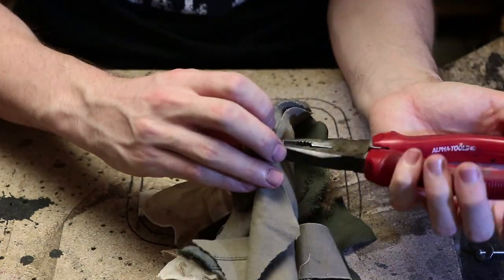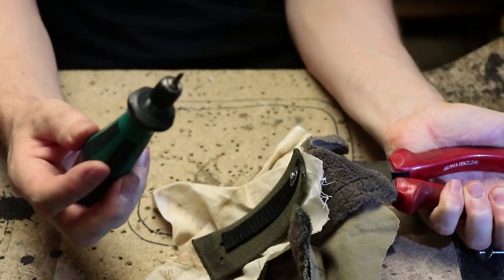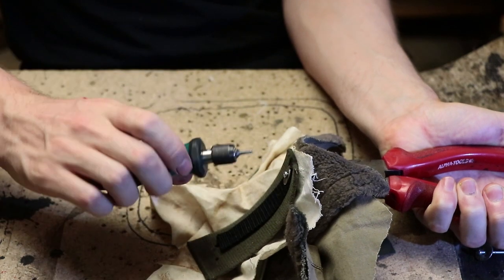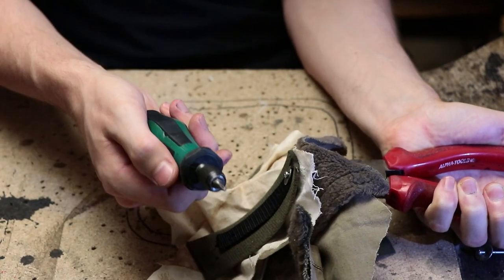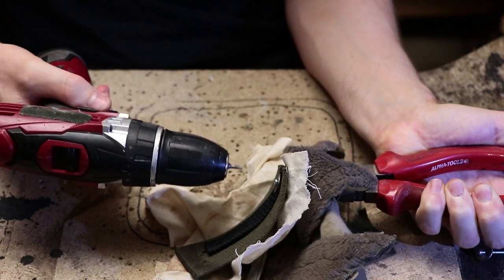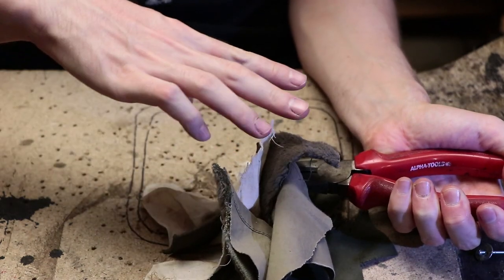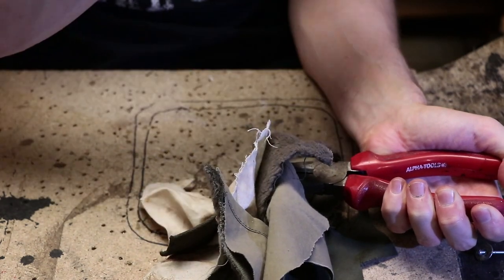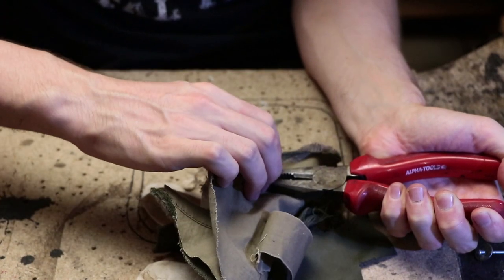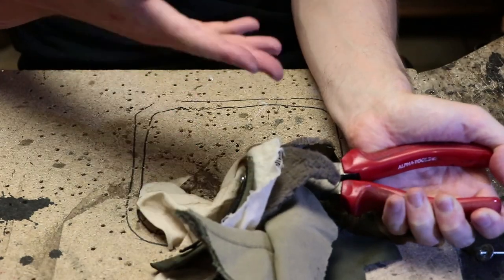When I'm done with that, I'll grab this nut on this side with my pliers and hold really tight, not letting it go. If I want the ultimate feeling so I can really feel the material, I'll use my manual screwdriver. Or I will use this electric screwdriver with a soft ratchet — the ratchet needs to be soft enough not to strip the bolt. In order for this whole method to work, there needs to be enough pressure on the bolts, and also thread lock needs to be used — we'll get to thread lock later in the video.